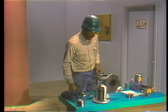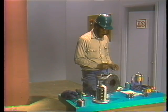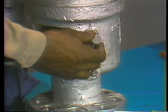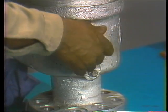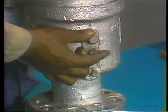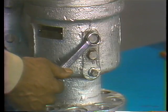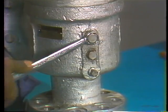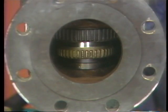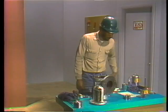To keep the upper ring in place, he installs the upper adjusting ring pin. As with the lower pin, he first lubricates the threads, then inserts the pin as far as it will go into the valve body and uses a wrench to tighten the pin into the notches on the ring. As a final check, he tries turning the ring to be certain it's locked in place. The spindle and the feather are assembled next.